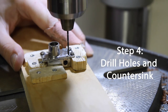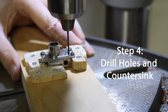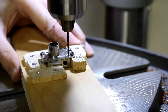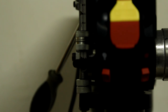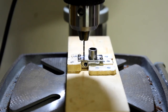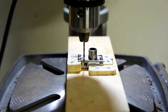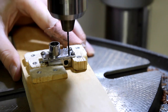We're ready to drill now. Take the drill bit and mount it in the chuck of your drill press. Make sure the table is level — I set the table height so that there is barely clearance between the bit and the post you're drilling into. Set the drill stop so that it drills about 2-3mm longer than the screws. Eyeball it on the side of the drill to ensure it drills beyond the screw length. If you don't drill deep enough, you won't be able to re-drill after the hole is tapped and you'll ruin the threads. But if you drill too deep, you'll drill through the tuner.